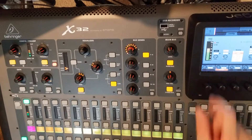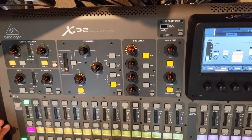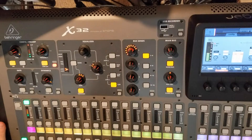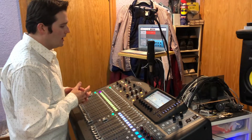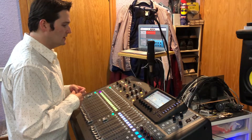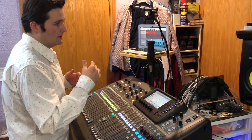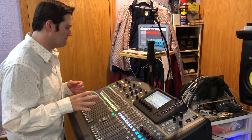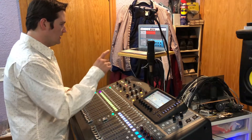I select preamp — as you can see, our level is pretty high. The gain is topped out at 60 dB, which is what these internal Midas preamps top out at. It's clipping, so in the recording you can hear what it sounds like to overload this preamp. Nice tube preamps can sound good when you overload them, but there are limits — the signal just can't get any louder past a certain point.